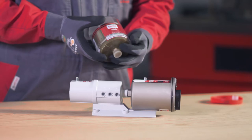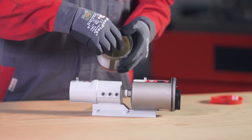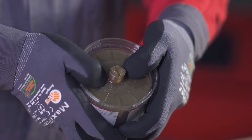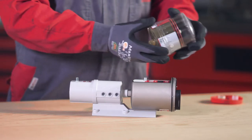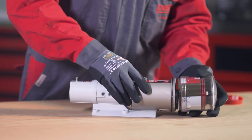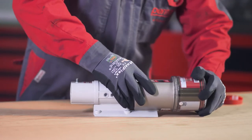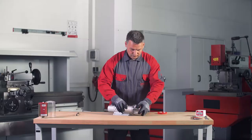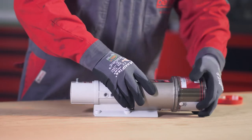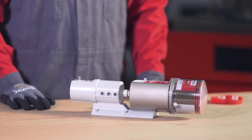Place the PRO-LC in the cover and remove the plug. Press the PRO-LC into the cover until lubricant is expelled from the outlet opening. Place the PRO-LC with the cover on the PRO-MP6 basic system. Make sure that the catch engages in place and the gear teeth on both components, the PERMA PRO-MP6 basic system and PRO-LC, mesh.